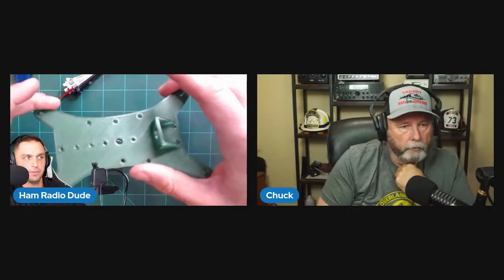The winder is designed for POTA and SOTA — not super ultralight like K6ARK style, but built to handle field use. It's printed in PLA at 40% infill. It held up all week doing Parks on the Air, and I took it to California too. Chuck's is printed in ABS. The winders are almost quarter-inch thick for durability.